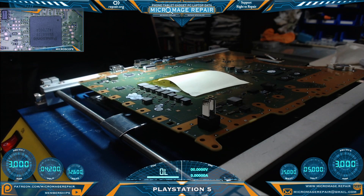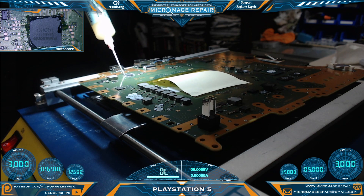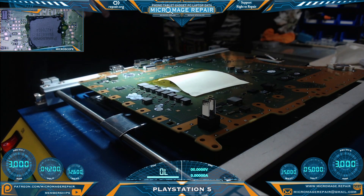PS5 motherboard — let me show you what's going on today. We'll be changing the encoder on this PS5 board that is not putting any video out, and it is not the HDMI port causing the problem. We believe it's the encoder. First thing I need to do is preheat the board with my T8280. We're going to add some flux around the chip and then watch for it to melt. We'll be at 150 degrees; if I have any problems pulling the chip I'll bump it up to 170.